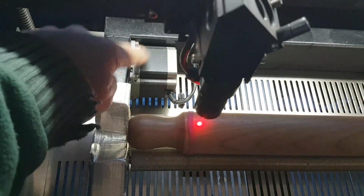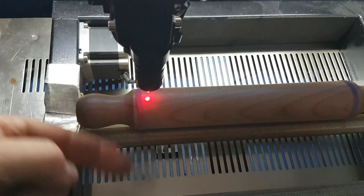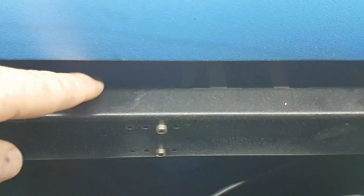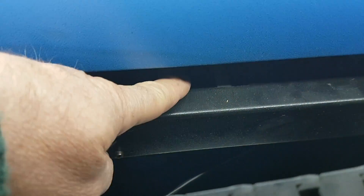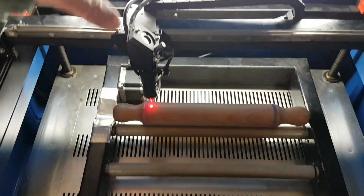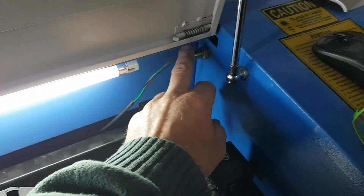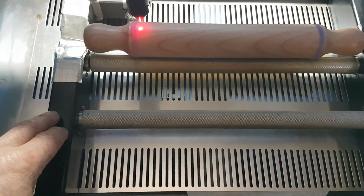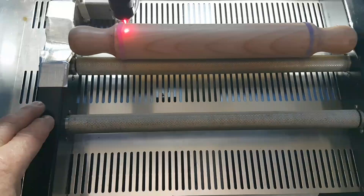To enable this motor to do the work of rotating, we have to disconnect the Y-axis motor — there's a motor in here which is the Y-axis motor. So basically you're disabling the overall Y-axis and plugging in the rotary axis. It just sits here using gravity because the laser exerts no force, so it doesn't really need anything to hold it.